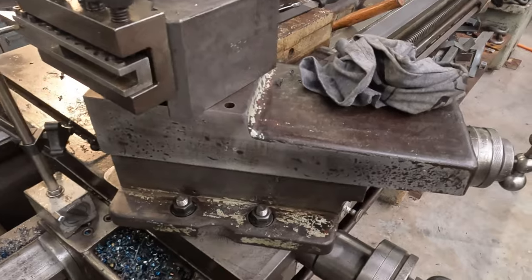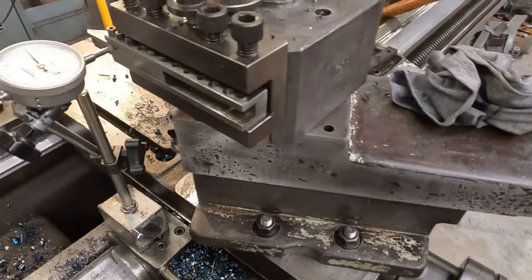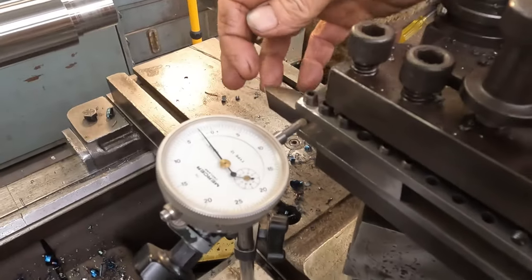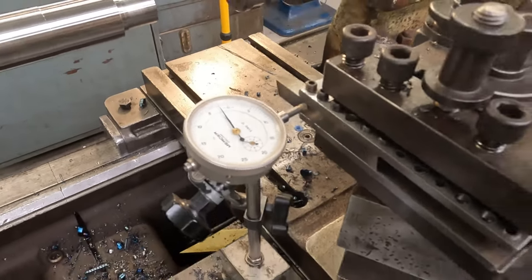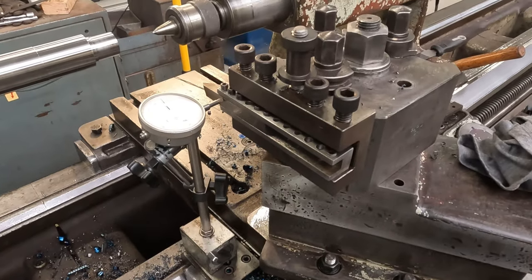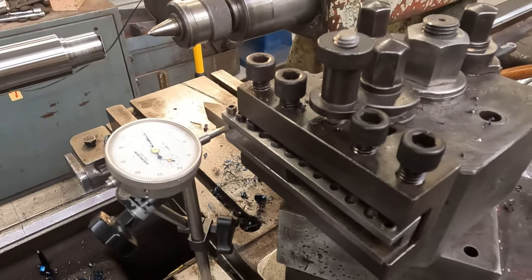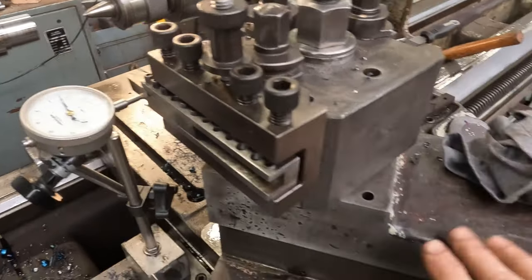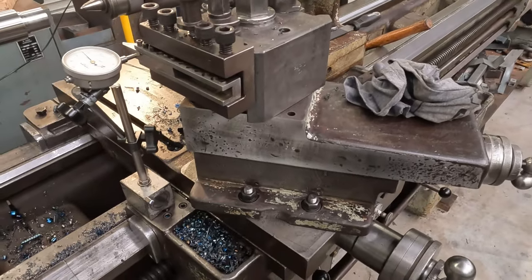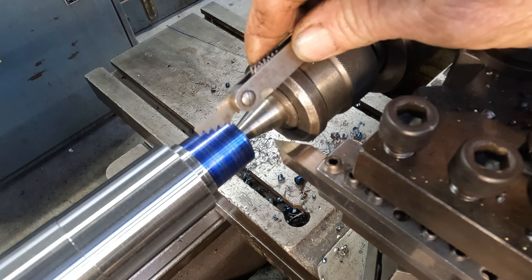We have our compound angled around to 29 and a bit degrees as we'll just be coming in and cutting off the leading edge of the tool, so we won't be plunging straight in this case, which I always do for the smaller threads. But as this is a bigger thread, 3.5 pitch, we'll just come in on the compound slide. Okay, we'll take a scratch pass so we can just confirm that we are cutting